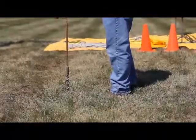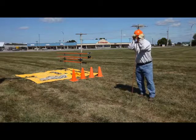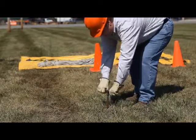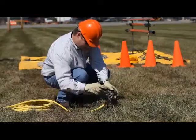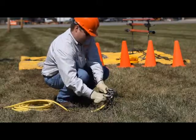Starting from the ground up, the temporary ground rod screws into the soil at least 15 feet from the pole. The spiral threads pull the 6-foot copper clad rod into the earth for full length contact as a low resistance ground. This now makes the bronze T-handle a good attachment point for connecting our first grounding set clamp. To make sure it's tight, a screwdriver may be used through the eye screw.